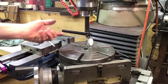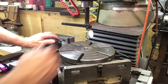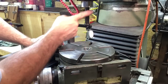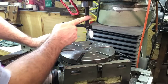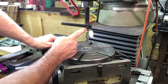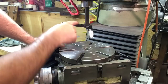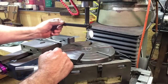Anyway, that's the tool — easy build. The hardest part is probably milling that slot. This shank — I used a one-inch bolt and just turned it down to three-quarters so it'd fit things easier. I rounded up the head, put a slot in, quarter-28 set screw here, 8-32 set screw here, mill the slot, put a hole in for the indicator to fit in. That's about it.